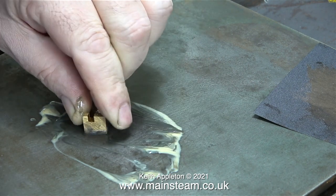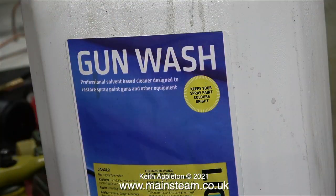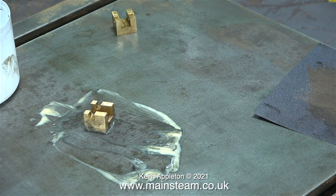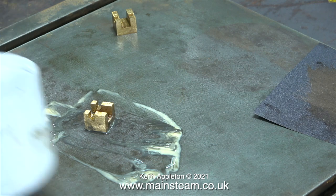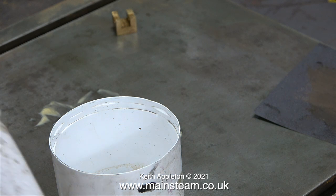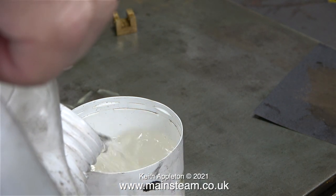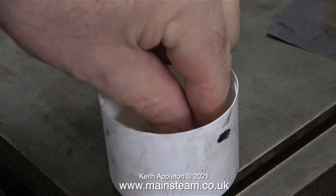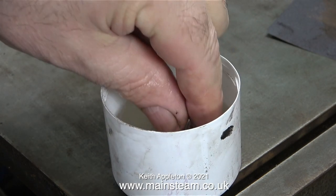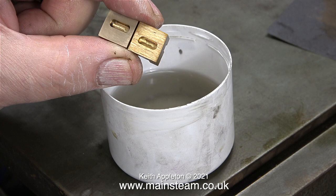The final job on each part is to clean away all of the abrasive, and for this I'm using something called gun wash. It's not very good stuff to handle — I use it quite a lot but try to keep my fingers out of it, and it's also a very good idea to use it in a well-ventilated space. As usual I'm using an aerosol can top, pouring some gun wash into it, then dropping the part in. There now follows a health and safety warning: don't do it like this, because it contains methanol and other nasty things.